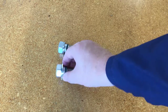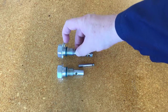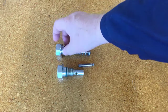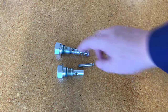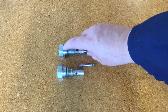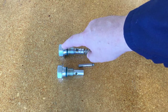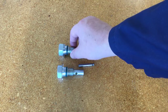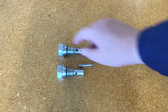You can see on this pump that there's one spacer installed, and on this other one there are two spacers. These are output-limiting spacers that pull the pump away from the cam a little bit, giving you a shorter stroke. Most applications don't use these, and it's really rare to use two. If you do have one or two spacers on the old pump, make sure you put them on the new pump as well. You can thread the pump into the body of the G3 most of the way and then just add the spacers at the end.